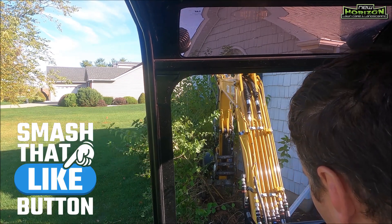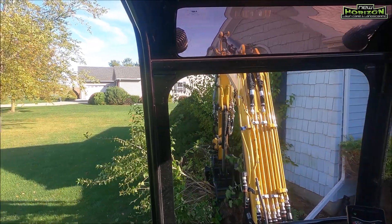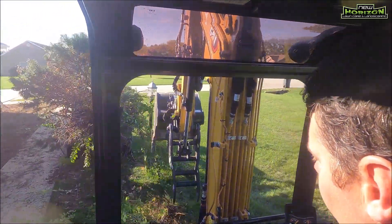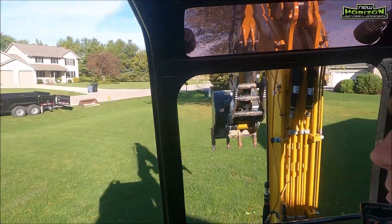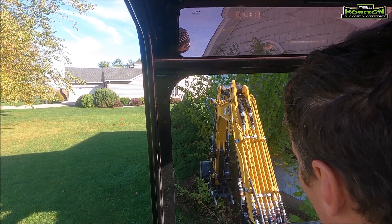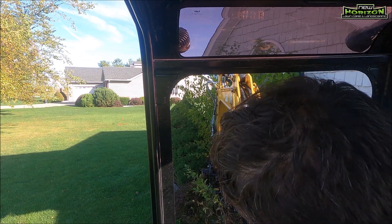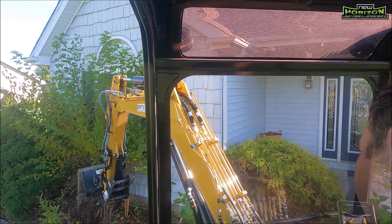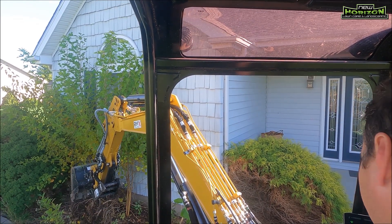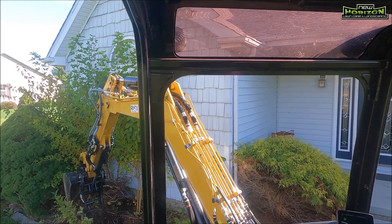There is a downspout you see there — we are going to be replacing those for her and her husband. They have some that have been in bad shape, and a couple around the house have been run over by a lawnmower from the previous lawn care provider. The downspouts were actually trenched in and buried underground, but they've plugged up and are no longer draining water. She just wants to put regular downspouts down, so we're going to get those fixed. We went ahead and took the downspout down off camera so we can till it all up, grade it, and get it ready for fabric and new rock — which will be in the next video.